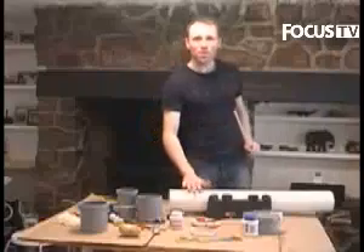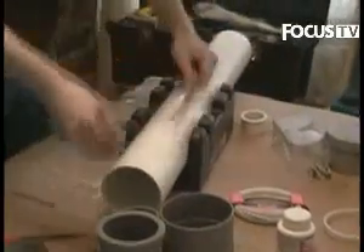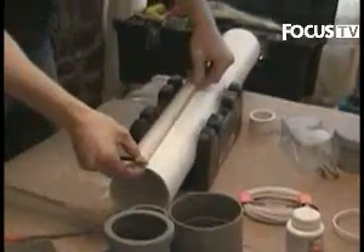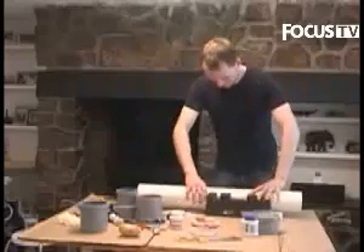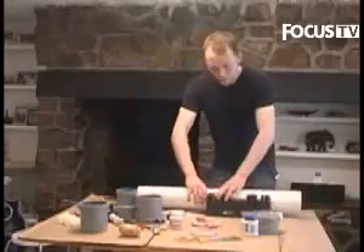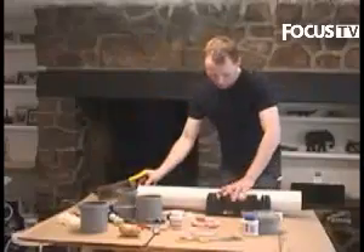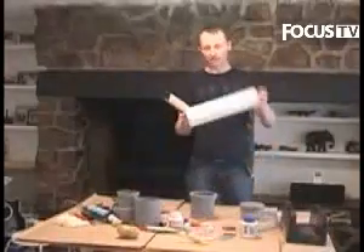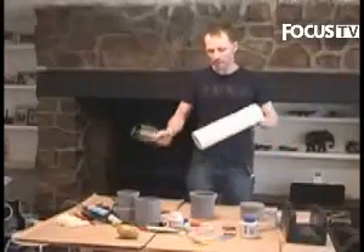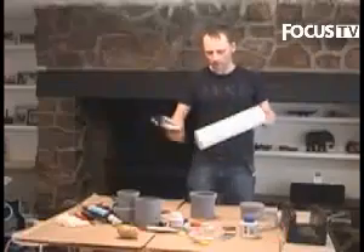This big pipe is going to make our combustion chamber, so we need a 40-centimetre length of this pipe. We need to do the same cutting process again in the jig to make sure it's a square cut, then file back all the swarf to make a nice end to glue into our connectors. Once you've cut your length of pipe, give it a quick brush-down to get rid of the last bits of swarf from the filing before we glue it.